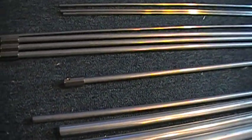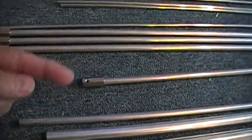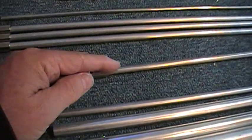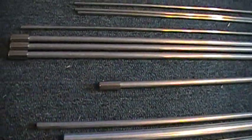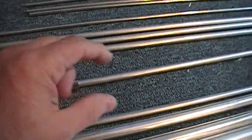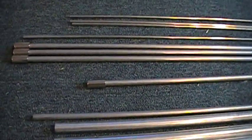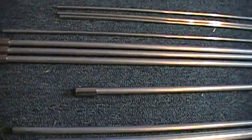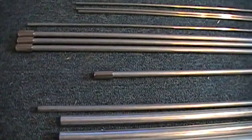But once you put your stuff together and you Loctite it here, use quality electrical tape and go around it on this thin piece, at least an inch above it, cover all the way over it, and go back onto the other side of it over here. In other words, put a good layer of electrical tape across it, and do the job neat, so that it makes sure nothing can fall off. Quality electrical tape will last years and years and years in the sun, and I can personally attest to that. Also, once I finished with the tape, I took a dab of super glue and rubbed it on the tape to make sure that it basically melted into itself and wasn't going to come apart.